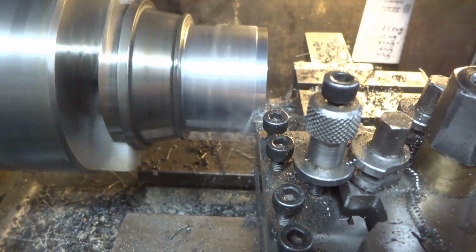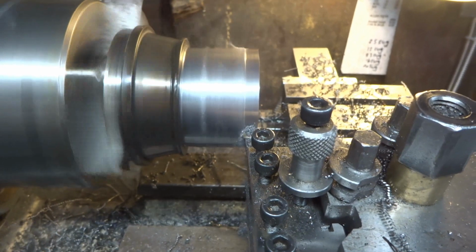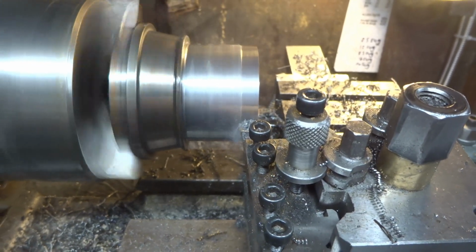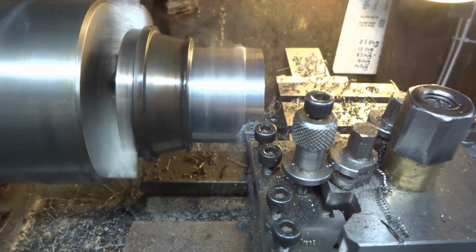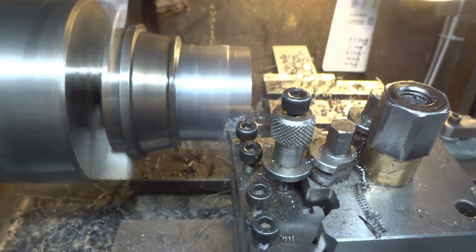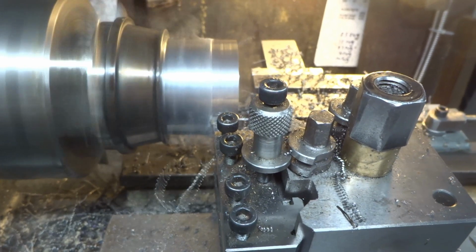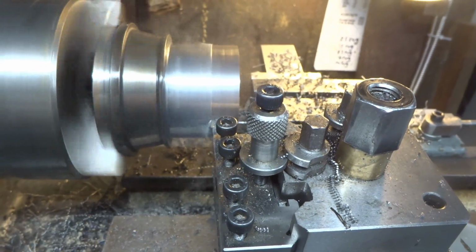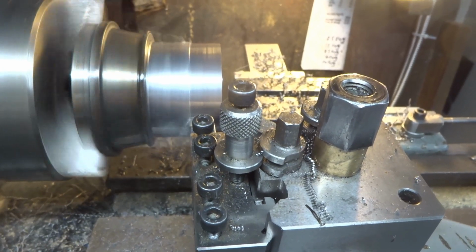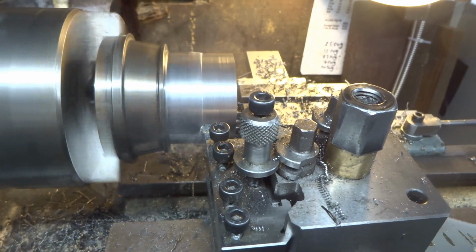So I'm turning the outer dimension of the flange down to 53mm, not the 52 that the spec would suggest. And the reason for that is, in my experience on the Garden Railway, on the track I laid, a few thou extra flange often makes the difference between coming off the rails at the points or elsewhere and not. So that's why I'm doing what I'm doing, based on my own poor track laying, of course.